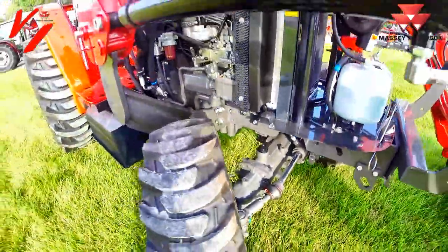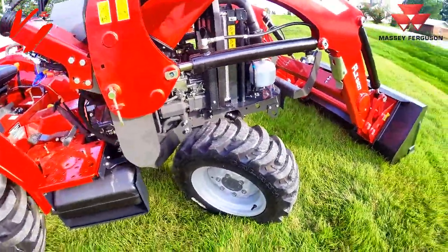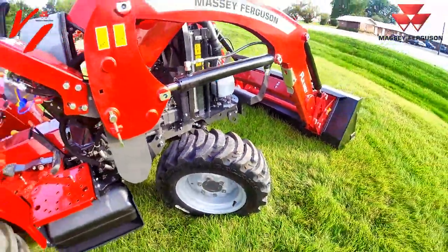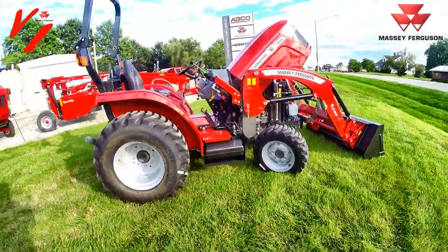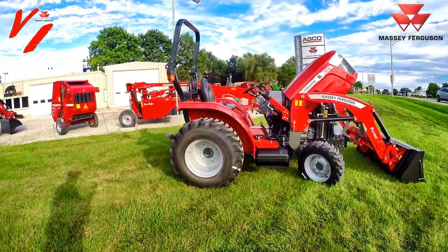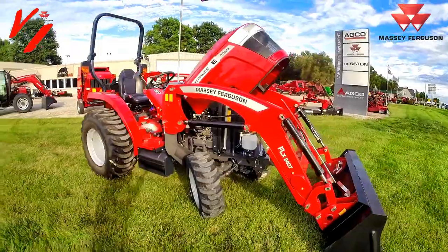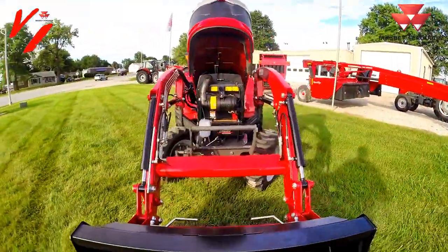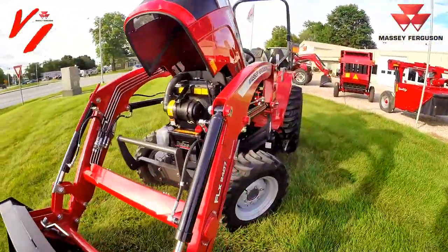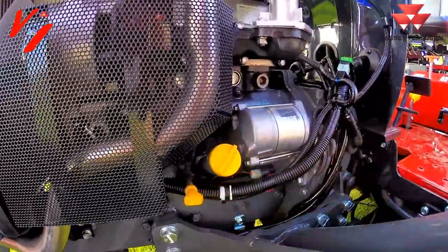This gives you great turning radius. It features the Galaxy R4 tire with a swooped lug design that gives you flat traction for long grass like we're on here, but also provides mud clean-out so when you get in muddy situations you have traction and a tire that doesn't tear up your grass as bad. On the left-hand side of the engine you've got your dipstick, engine oil fill, starter, and alternator.